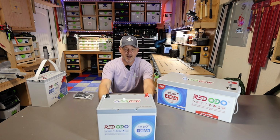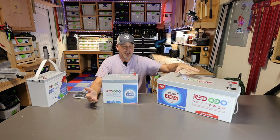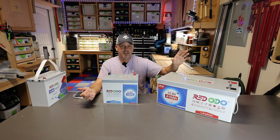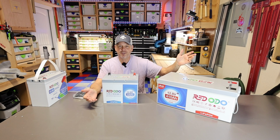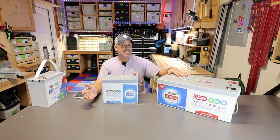I had a lot of questions on my camping video this summer regarding the battery, and I didn't really go over it that well. But I use this battery. I did do a capacity test on this thing when I got home, and running it at a pretty low wattage, around 120 watts, I got 401 amp hours. If I would have done the capacity test with around 200 or 300 or even 400 watts, I probably would have gotten 410 amp hours or a little bit more. But this thing ran for almost a day and a half off of those 120 watts during the discharge test. So I'm not surprised that I only got 401 amp hours out of it, but that's kind of what I use for my AC setup.